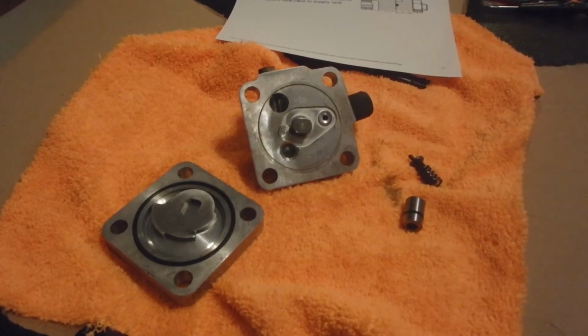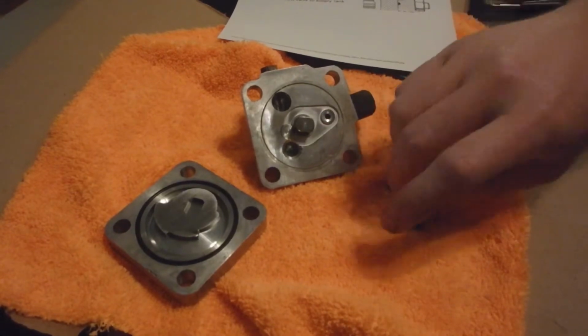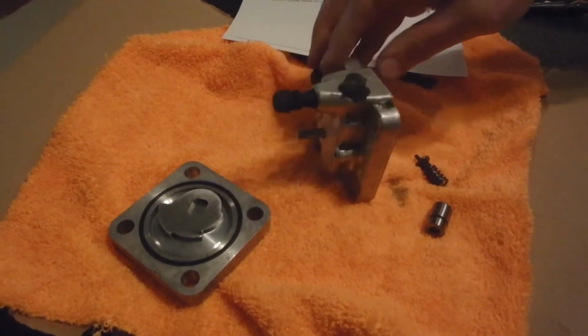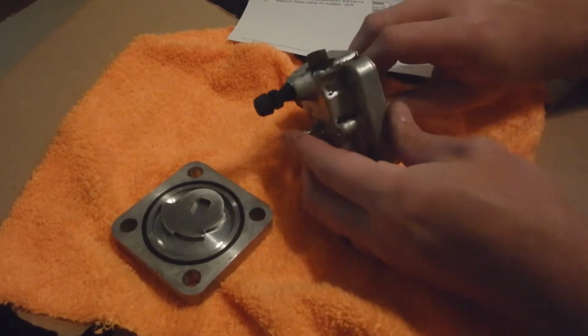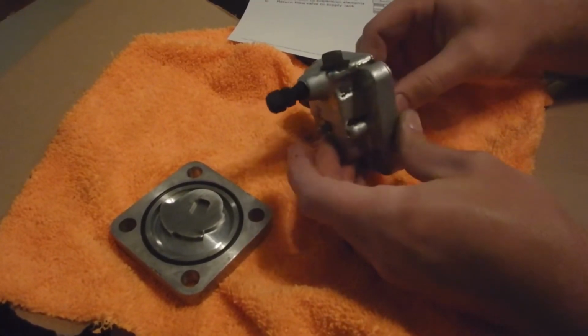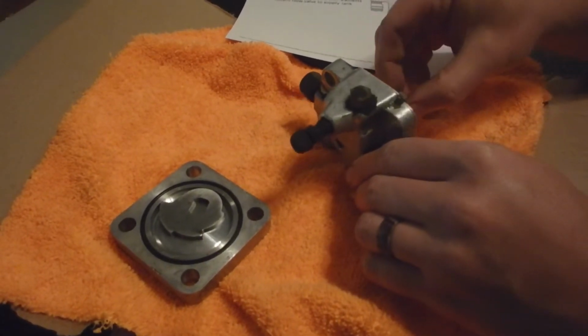I'll put all the O-ring sizes in the description. So that's 1 and 2. And then you're going to have 3 and 4 in here. So we need to pull this shaft out. And keep in mind, notch goes towards the bleeder, at least in my case.